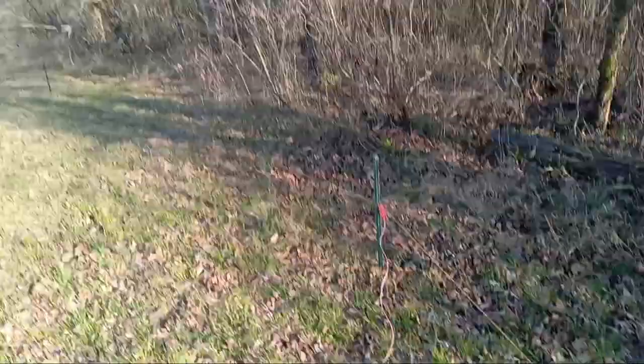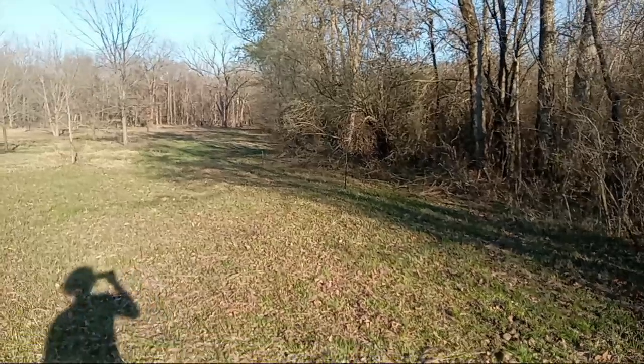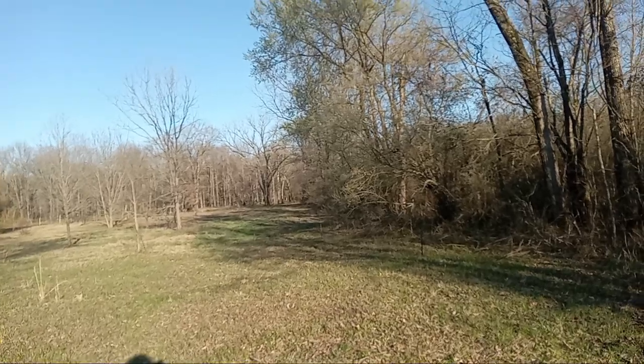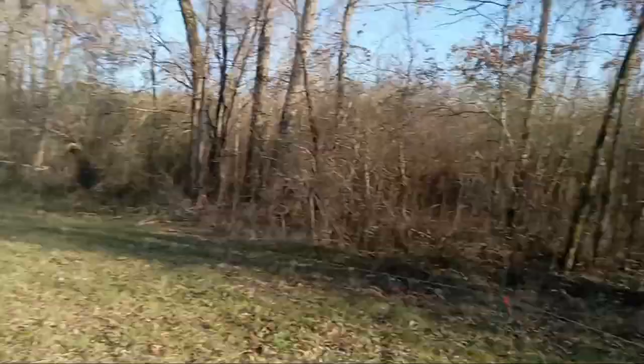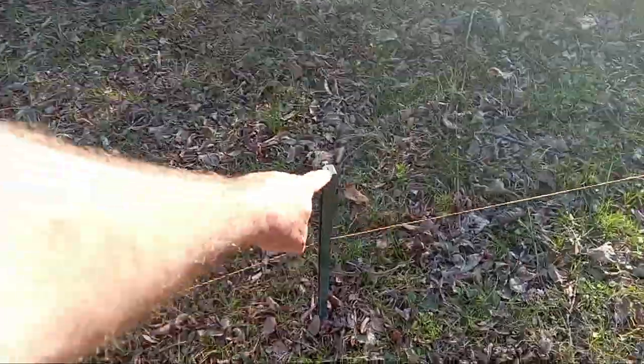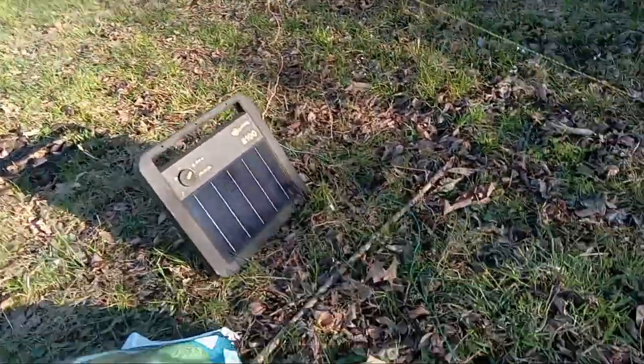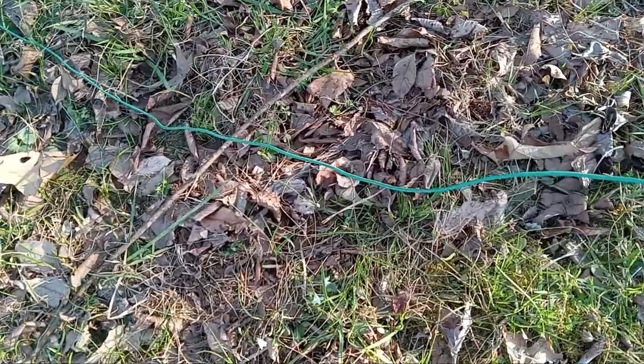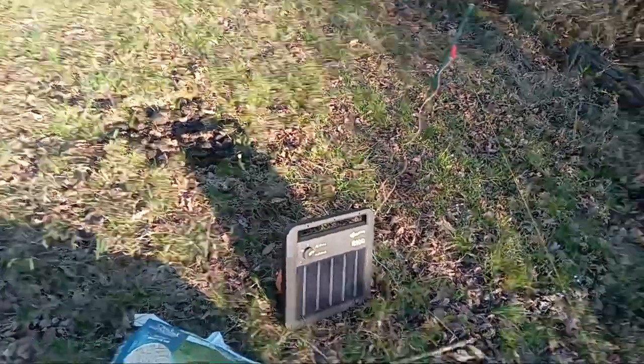Now that whole line of wire was very cheap - less than 20 bucks - and it goes looks like nearly 4,000 feet. I've got a lot of wire on this one. This is poly wire. And these little posts were less than $2 each - they're just plastic. And I'll show you the best thing I've got. You've got to know if it's working. Now if the fence falls off and hits the ground, it's not going to work. If the wire's hitting the ground or if it's hitting any kind of weeds, it's not going to work. You want to make sure it's absent of contact.